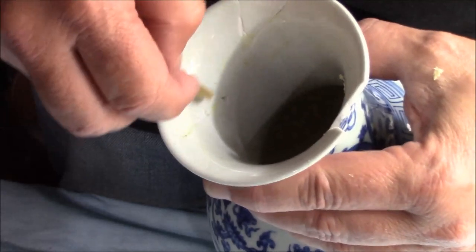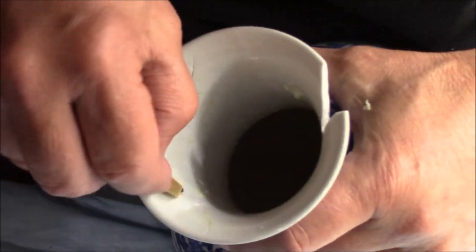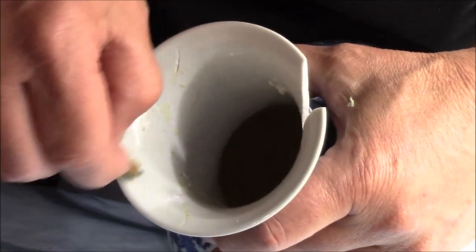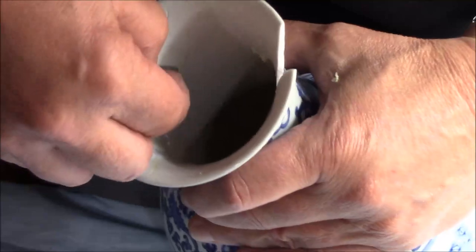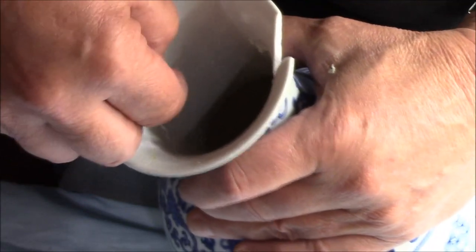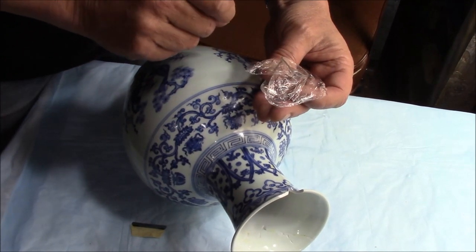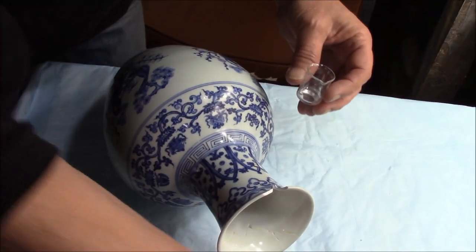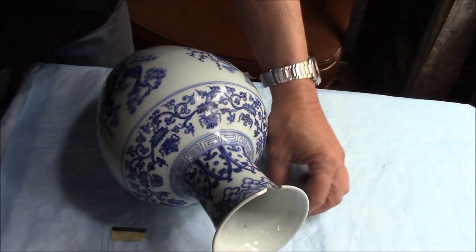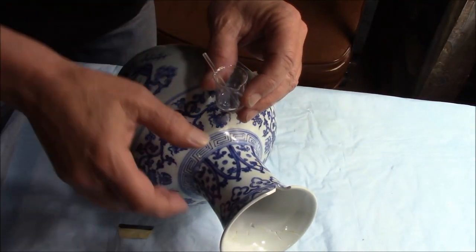And I'm getting ready to do a second round of Hxtal on this, where, as I said, wherever there was a lot of tape, the bonding agent may not have flowed underneath the tape. So I'm just gonna add more to make sure I got it where it's supposed to be. So I had my Hxtal in my beaker pre-mixed. This is leftover from yesterday. It spent the night in the freezer, and I've thawed it out. It's still very liquid, very thin.